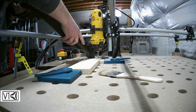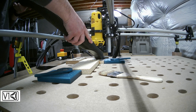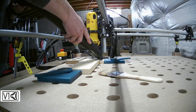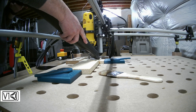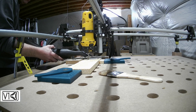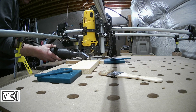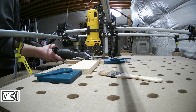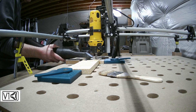I like to try and keep the work area clean — I use a normal shop vac and just clean up around the area, removing any swarf sent out by the cutter. Sometimes it goes all the way across the table. My MPCNC is quite large so I like to keep everything as clean as I can during the cutting. When I get to the cleaning pass I don't necessarily need to use the vacuum because it takes such small cuts — there's hardly any swarf or debris — so I like to do the vacuuming during the first cut, the main file part.